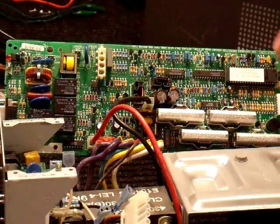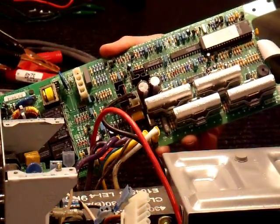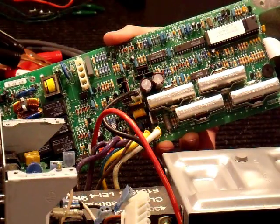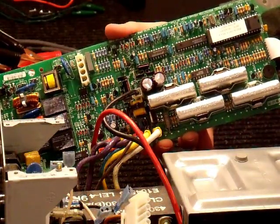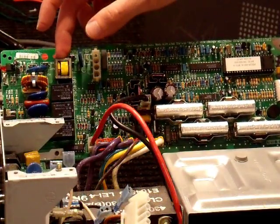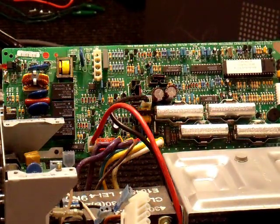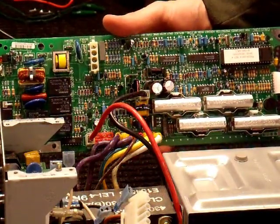It's clear from looking at this that they intended it to run for only a short amount of time. These are just big blocks of metal that will warm up over time and eventually overheat, but their intention was that with this small battery it won't run long enough to make too much heat. So I may have to do something there to improve cooling if I want to use this as an inverter. And here is a current transformer — it has a single loop of heavy-gauge wire and a whole bunch of loops of fine wire. What that's doing is sensing your output current so the board knows how much load you have, to either adjust certain things or shut it down due to over-current.